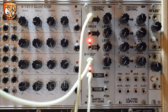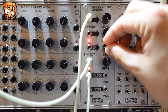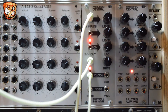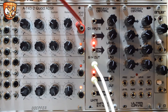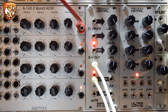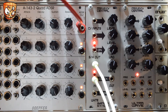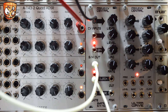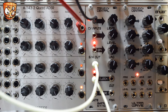Because we're only using one of the inputs we can add some of the noise when no input is present. Here I'm bit crushing and downsampling audio again but this time on a bassline — I've got a mix of oscillators going through into a filter. First here's the sound without the sample and hold, but taking the filter's output into the sample and hold and then going directly from there to my sound card, turning down the square wave VCO output which is acting as a clock, we get a really nice bit crusher effect.